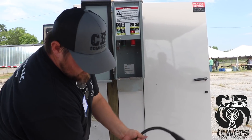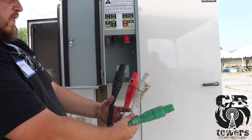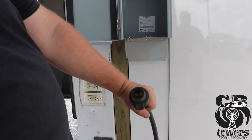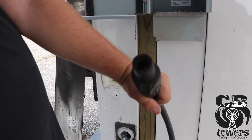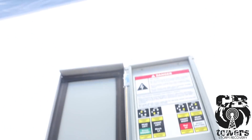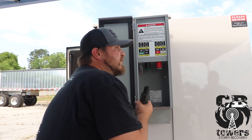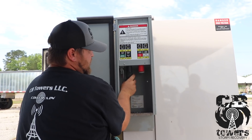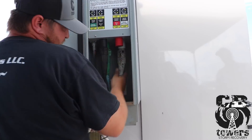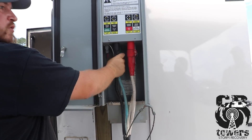These are your tail ends — cams. They're all color coded so you know they match what's over there at the power panel. There's a little set screw on the very inside. Underneath here you'll see a flat part; the set screw has to go to the flat part. Sometimes that's turned sideways — just identify it and orient it to make it easier for everybody hooking up. When you get them twisted, just give it a little yank; that little screw will keep it locked in there.